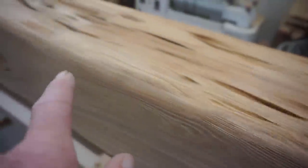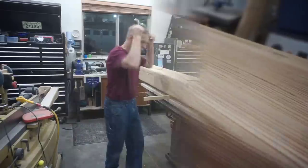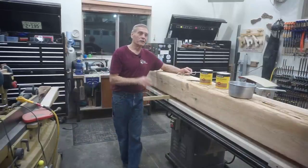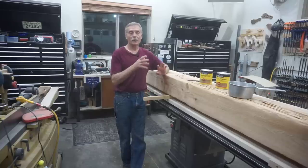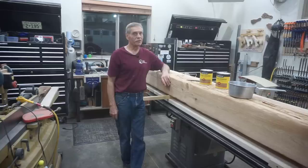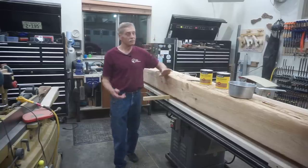And these are all sections that were essentially clamped with pocket hole screws and nothing more. So I hope you'll agree that this method of using those clamping blocks and this sequence for prepping, assembling, gluing up, and finishing this beam yields a pretty convincing result for producing a 30-foot faux beam out of real wood.